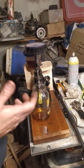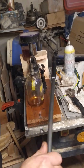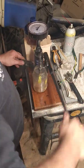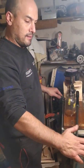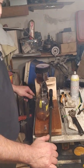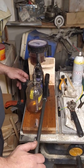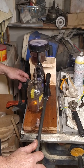and I'm going to start testing the injector for opening pressure, and obviously the pattern of the 5 jets. Everything is attached. Now I'm going to pump and increase the pressure. The pressure, according to Yanmar, on this type of injector, has to be from 195 up to 205 kilogram per centimeter squared. The pressure gauge that I have here is bar, so I converted the values, and it should read 191 to 201 bar, or in PSI, if you would like, 2773 up to 2915.